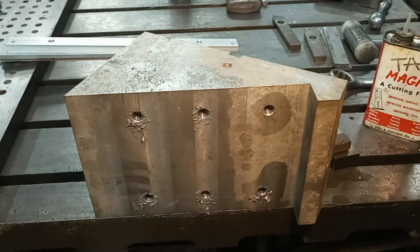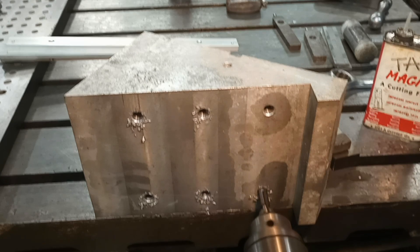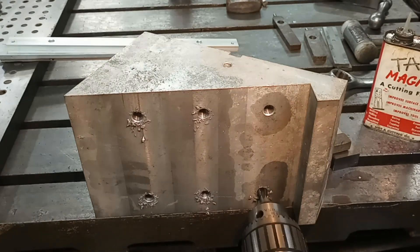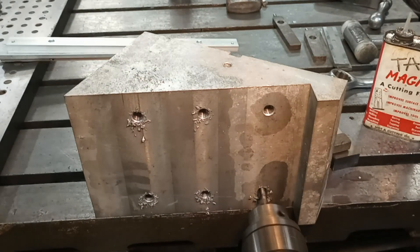I don't want to clash the gears, so I have to rock the spindle by hand. If you watch the spline drive shaft just before it stops spinning, you can quick-shift gears smoothly.